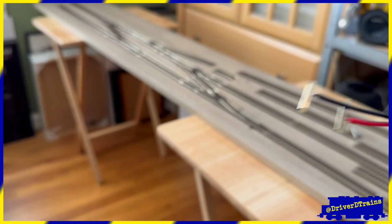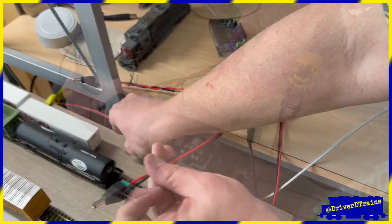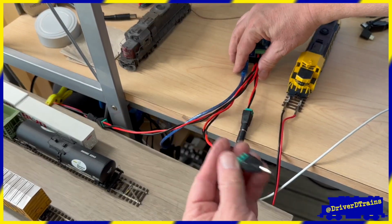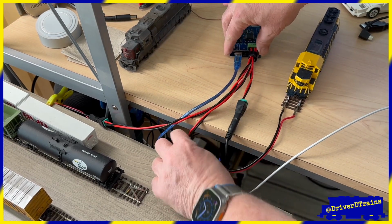I soldered 2 pairs of track feeder wires onto 2 sets of rail joiners and attached female barrel plugs at the other ends to plug into the male plugs I had installed on the leads coming from the motor shield. With this wiring in place, the DCC-EX command station was now hooked up to the layout and the programming track and ready for power to run the trains.